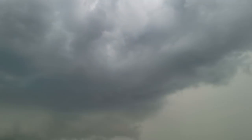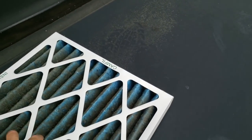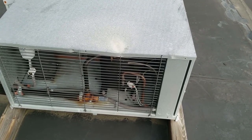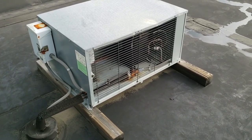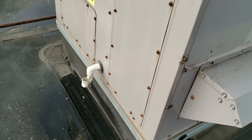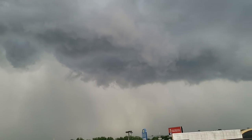Clouds are going to hit here any minute now, so we're going to get this sucker back together. Going to throw these filters back in for now — didn't have time to change them, we'll just have to come back. Everything's going to be closed by now anyway, and they'll be fine until then — it's not like they're plugged solid. I'm going to go ahead and replace that pressure switch because it only hit about 400, so it's off about 20 to 30 pounds. I really can't have that tight a tolerance. Everything's dropping in temp and coming down quickly — you can tell it's doing really good, pulling the humidity out. Just about in the nick of time.